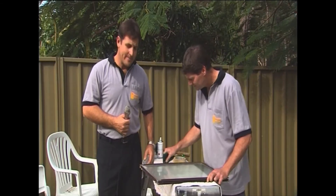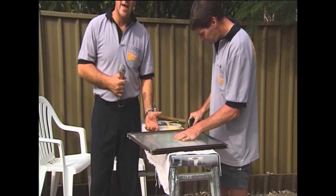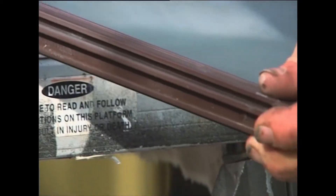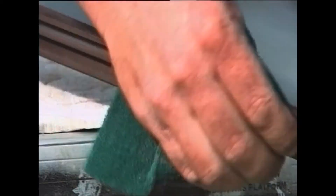With the sash here, you'll notice how Pete's just scouring it. We don't have to sand it right back to nothing — the surface is quite good so it just needs to be keyed up. What that means is roughing it up a little bit so the etch primer can stick to it.